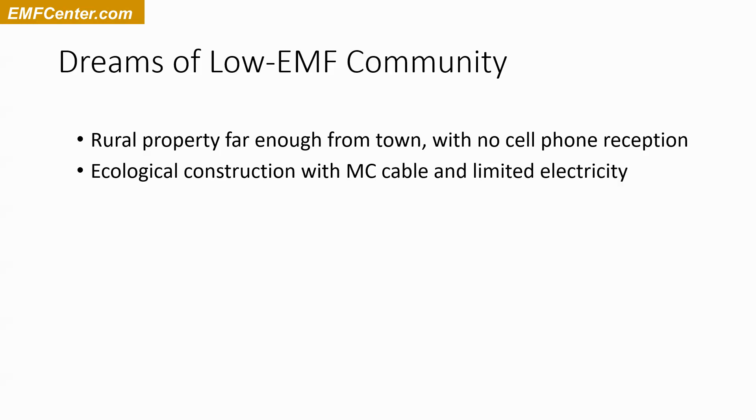Sometimes people who want very little electricity really need like one outlet in every bedroom, not four or five. We sometimes have a circuit that feeds one electrical outlet in each bedroom, and then another circuit which feeds other receptacles throughout the bedrooms — but that second circuit has the breaker kept off. They're putting in the electrical to meet the codes, but then turning the breaker off so there are fewer energized wires. Those are the kinds of choices I'd be making in my community.